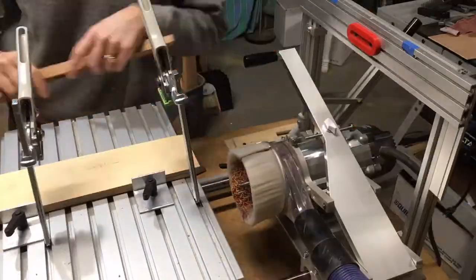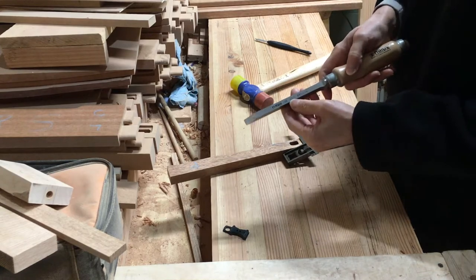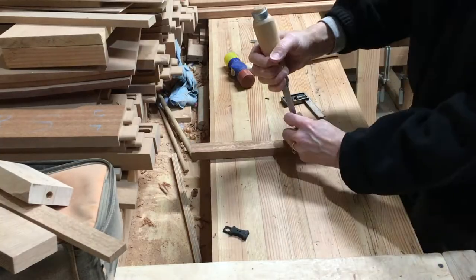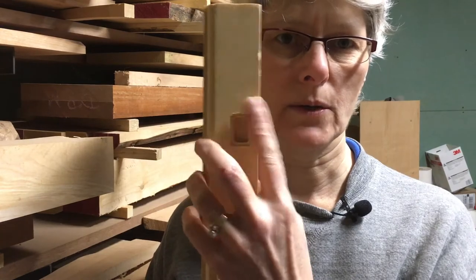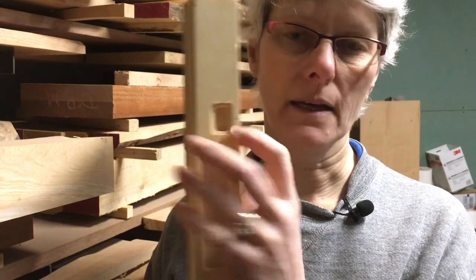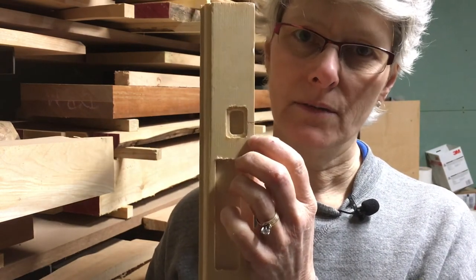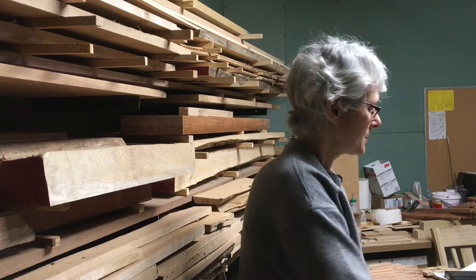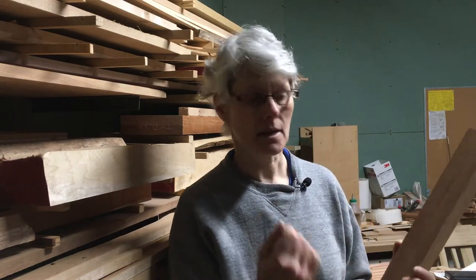I'm using my 10mm chisel, which matches the 10mm hole. I always make sure I cut a test piece before I do the final. This is my test hole that I just routed using the quarter inch bit and the 9mm follower on the outside with a 22mm follower to get the inside offset. It comes out just perfect for my tenons to fit into those for my stretchers. The process for the back legs is similar to the front legs — I'm going to be using the same template, the same bearing guide, and the same router bit.